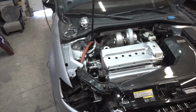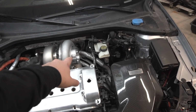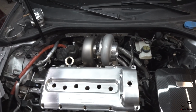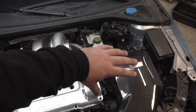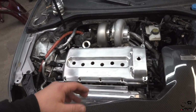Specifically today, we're going to be TIG welding. We're going to be making an intake tubing that's going to go to the carbon box for Integrated Engineering. I think I'm going to do that out of stainless pie cuts. It's not going to be forever stainless. I think I'm going to make a mold out of it, make a carbon fiber tube, but for now we're going to mock something up in stainless 5-inch tubing. It's massive. Wait till you guys see it.